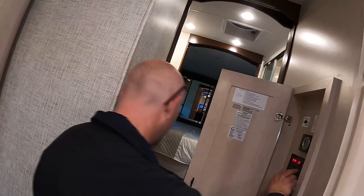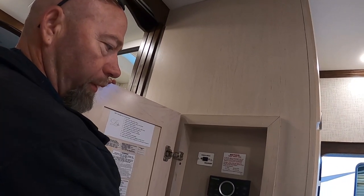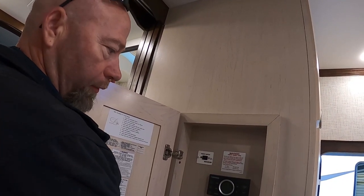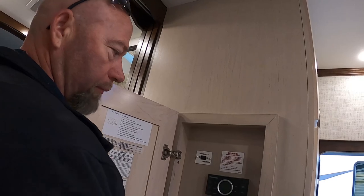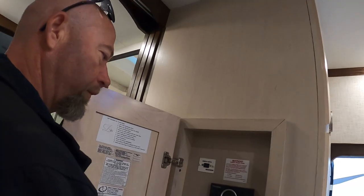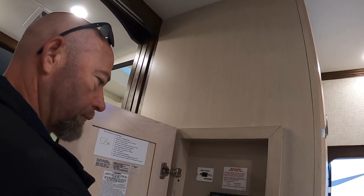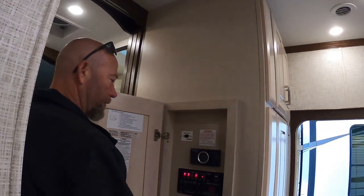This is your hour meter for your generator. This is the remote start for it — just like the one over there. You're gonna push that down till the little lock comes on, about three or four seconds, and then start it up. You just push it up — you gotta hold it until it starts completely. And then this just shows how many total hours are on it.